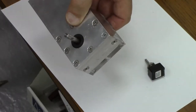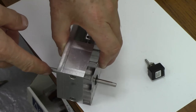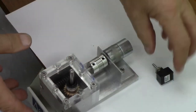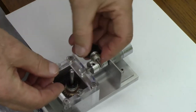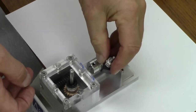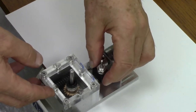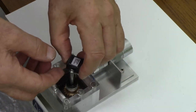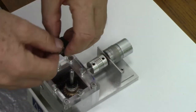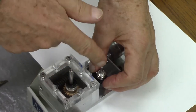So I've now got a shaft coming out both sides. That one will drive the rudder, and this one, I thought, would be used to drive one of these Bourns EMS22A50 absolute angle position sensors. Problem is I can't actually put it there because that would make the whole thing too big to fit in the box, or the boat for that matter. So I've got to put it somewhere like that and transfer the rotation from here to there.